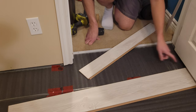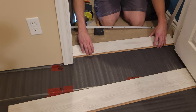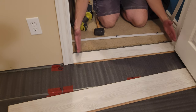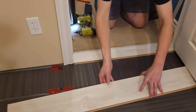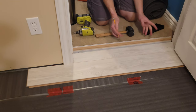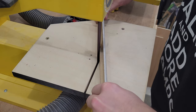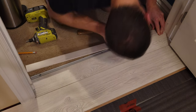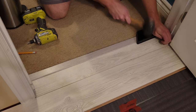We've got our first piece and our second piece with the little groove cut off either side — we'll just slide this guy in first. The reason I had to slide it in from this direction is that the door jamb is on a slight trapezoidal angle, about one degree on either side, so it wouldn't fit straight on. Now our seams are nice and tight. Because my tapcons stick up a little bit I'm going to mark where they are and carve out a small notch with the bandsaw or strip sander.